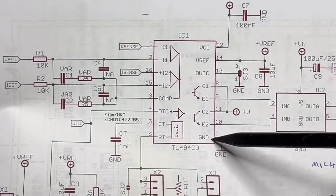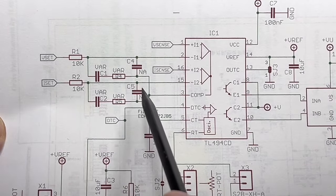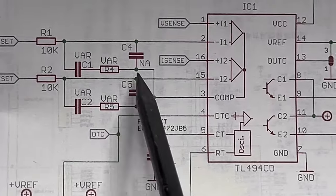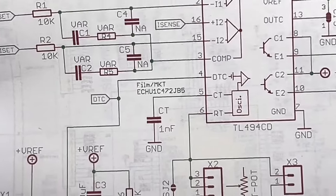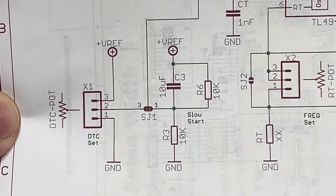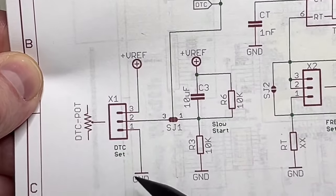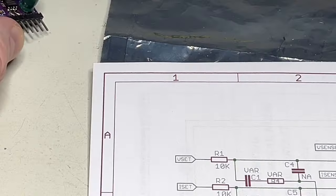So this is the TL494. I included a very flexible compensation circuit here that you can populate however necessary, depending on how this will work, the frequency and everything. Further added is a dead time control, because this chip has a dedicated dead time control pin. So you can either use it with the onboard pot, this one, if you want,